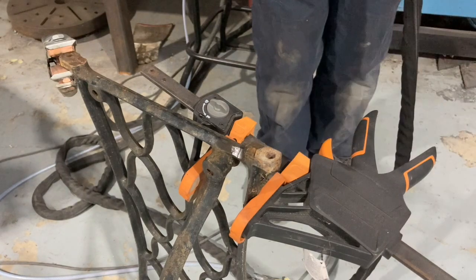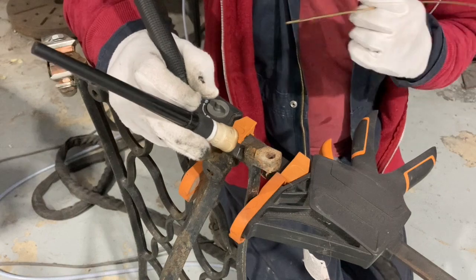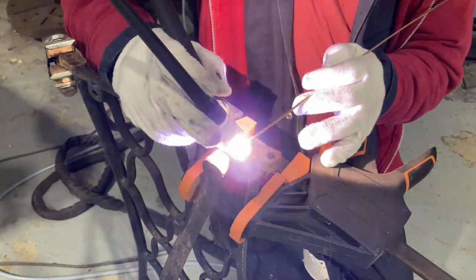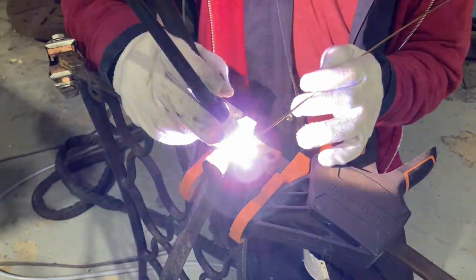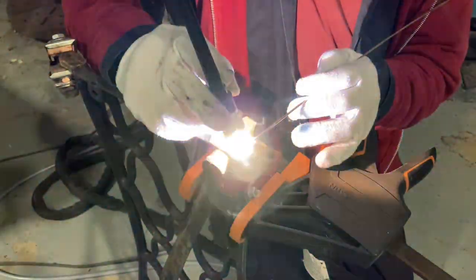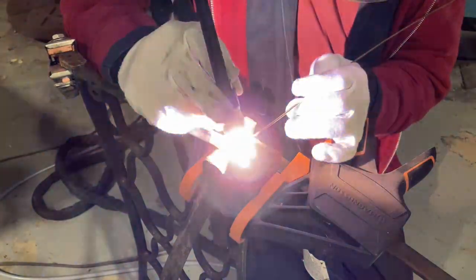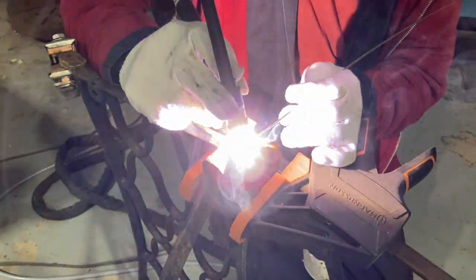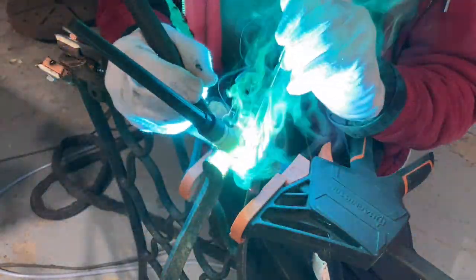I'm using aluminium bronze on AC. I saw Jody doing this on weldingtipsandtricks.com and found it had quite a bit of success with it on cast iron. This cast iron is really old and dirty but it can still work. I only want to stick this thing together — it's not critical. I'm just letting it preheat a little bit before I add any rod. The thing to do is you just barely wet the surface, get the metal hot enough to accept the filler, jam a little rod in, and when it forms a puddle of bronze, keep the arc a little bit backed up over the puddle and just work the puddle forward. It'll spit and pop a bit if the cast iron gets too hot — impurities will come right out of it. Check out Jody's video on welding cast iron with aluminium bronze — I'll try and put a link in the description.